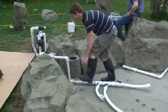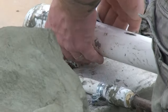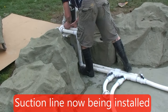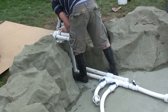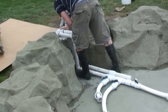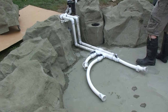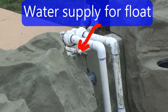We are attaching the pump's discharge line, which feeds the three individual bubbler rocks. This line is also being connected by union, as well as each of the bubbler rocks themselves being connected with a union. All elements of this plumbing system are totally removable and not routed through the concrete shell — in other words, no leaks. You can't bond concrete to PVC; it's going to leak. That's why we plumb after we've built, and we can totally remove and renew any of the elements therein.